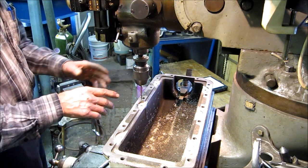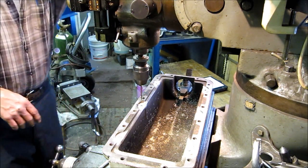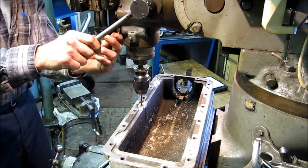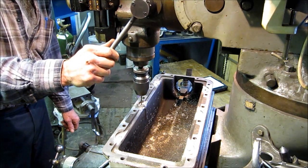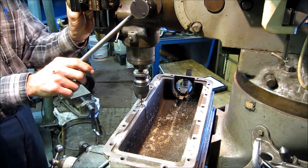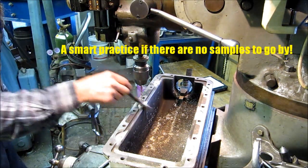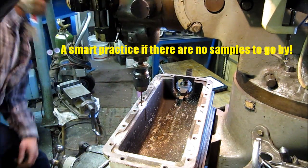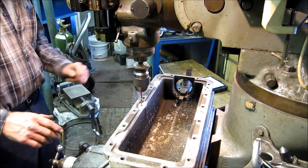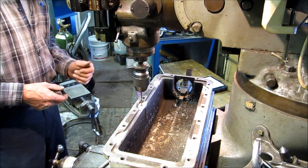It takes a little bit longer and we've got to do one hole at a time. I'm not just doing this operation and moving over because I'd have to reset up on every hole. This way I pick where center is and then go with it. What I did is I went through and set the bottom to find out the depth the machine was at — that's what I mean about probing. I brought the drill bit pretty close to the top: one inch. So we've got one inch to play with, and we don't want to bust through this side. It looks like there was about three-quarters of an inch of threaded bolt in depth, so there's a quarter-inch pocket down underneath.